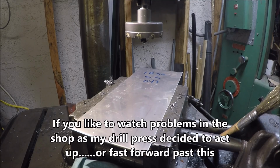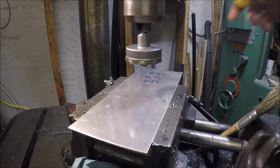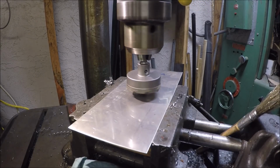This is about 2.5 inch diameter. Again, the feed and speed on the pilot drill, I had to make a switch out, get the speed up, and then get back down. And the success of the hole was very, very simple to drill. And again, it's just monitoring the gullets if they start to fill up. But it was a successful cut and a good tool.